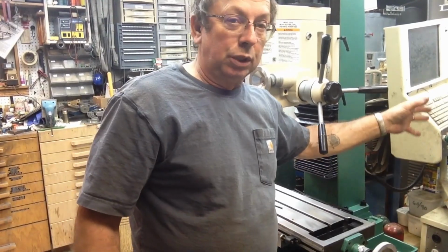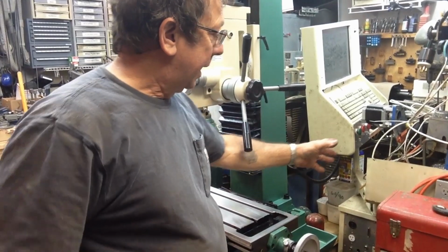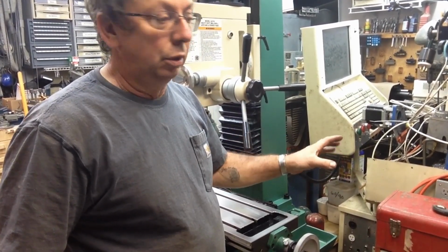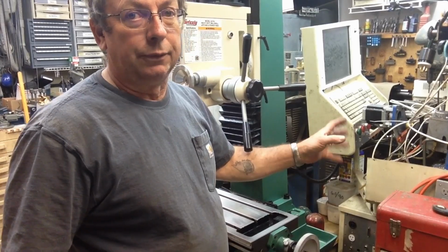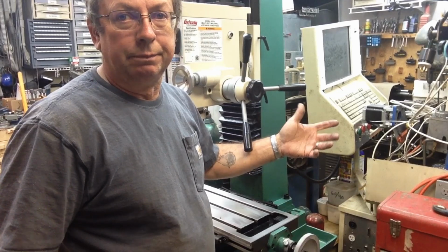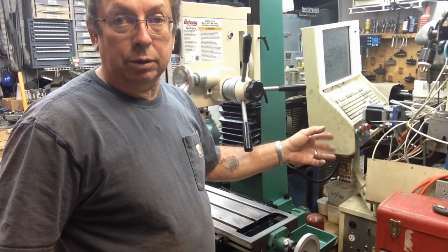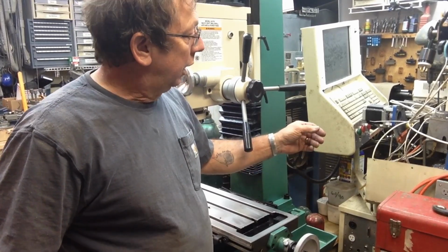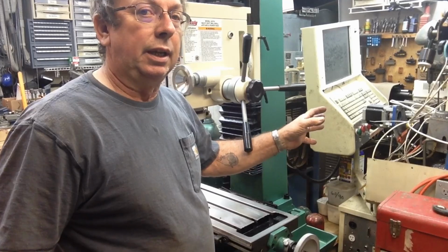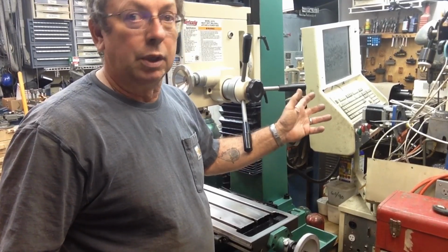Mounting it on a base plate so it's freestanding, and I can mount it at the back corner of the mill on either side probably, and be able to bolt my accessories on there. If I go ahead and pre-drill a piece of 4x4-inch square tubing, you know, quarter wall thickness, something that's substantial, not going to move around, is going to hold tapped holes, go ahead, pre-drill it, pre-tap it, have it ready, and then any accessories I have that I mount on there, why, I can just drill and bolt on accordingly.